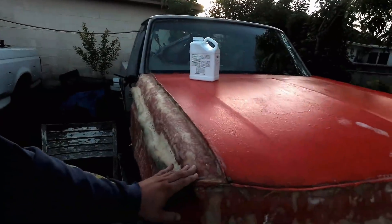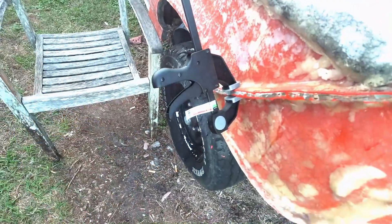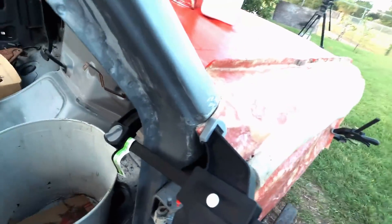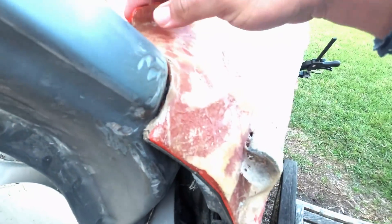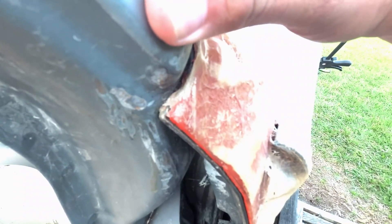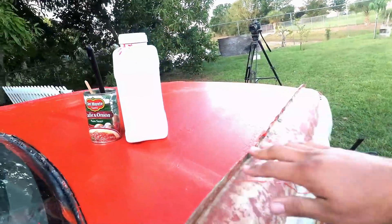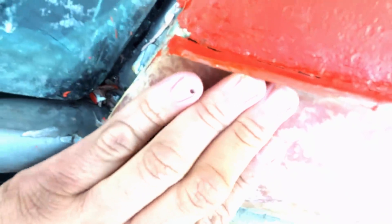Also, because of all the rain, the other molds have started separating, which is a good thing because we know it's going to come out pretty nice. I have some clamps on there to hold everything together so it doesn't separate. Let me release this clamp so you guys can see — there's quite a bit of movement here. That's the mold separating itself right down there. So we're going to put the clamp back to keep it tight and snug so it doesn't change the dimensions of the mold. We also have to correct this edge here due to the separation, because the gel coat broke in between.